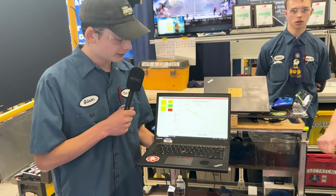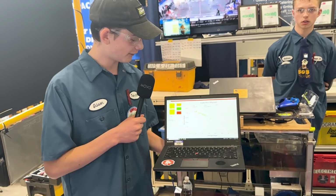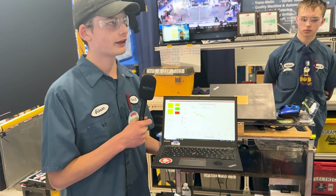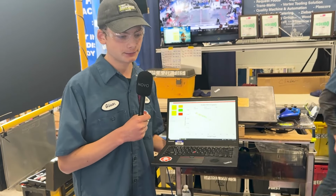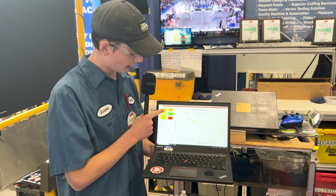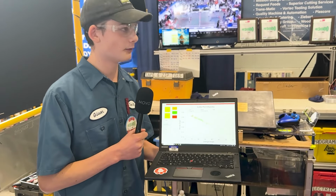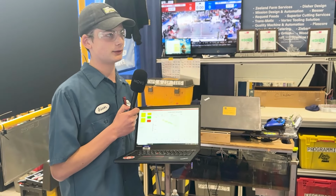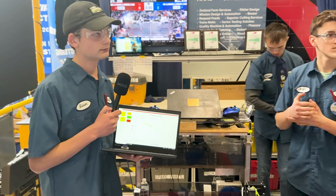Basically, we have this tool that we can watch drive practice, and every single time we shoot, it will log the height of the April tag on the speaker and our pivot angle. What this allows us to do is press if it was too high, too low, or if it went in, and if it went in, it'll automatically add it to our points so our regression can be as accurate as possible. Awesome. Mechanically beautiful robot.